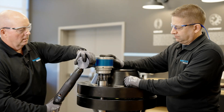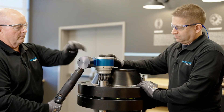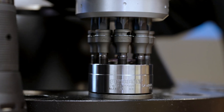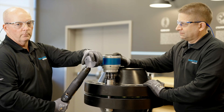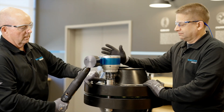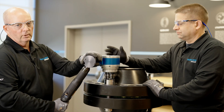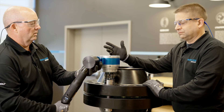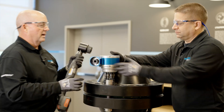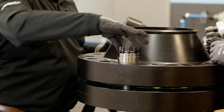So we're in. Now we'll actually begin the removal process. Focus on the jack bolt. Now at this point, the jack bolts are all loose. You can see everything turned out. In some cases, you could actually continue with this until the jack bolts come completely out if you wanted for extra cleaning. Take your unit back off and you can see the nut spins freely.